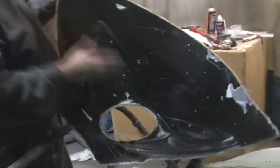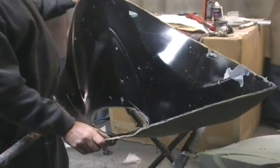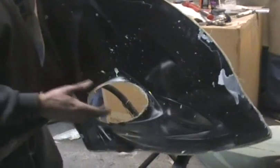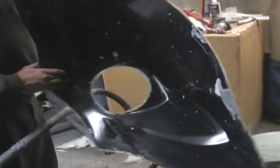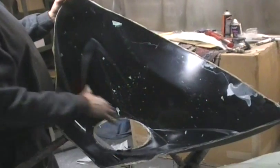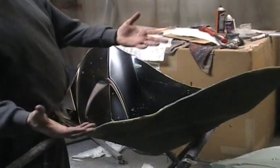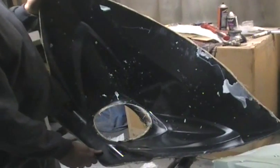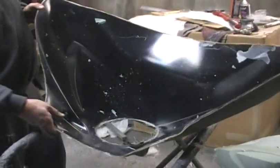This is the mold we made. What we've got to do now is wash it up and clean it real good. To make a really good mold, you take this and you buff it super smooth, then wax it so nothing will stick. Since this was our first one, we have to do that now — it's called conditioning the mold. Once this is all done and we have it waxed, we'll spray the gel coat, put the fiberglass mat down in there, lay it all in by hand — then we'll do the same thing again, pop it apart, and we'll have another fairing. That's basically how you make fiberglass parts with a mold. Nothing really hard — just a little behind-the-scenes look here at Witch Doctors. Thanks for watching.